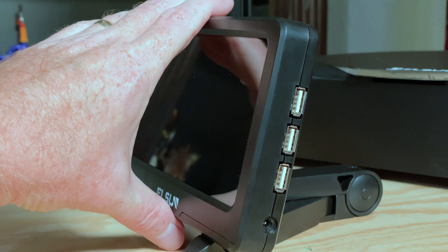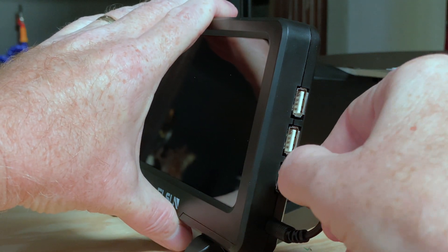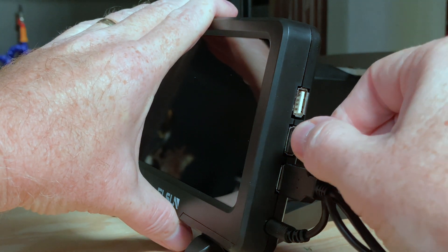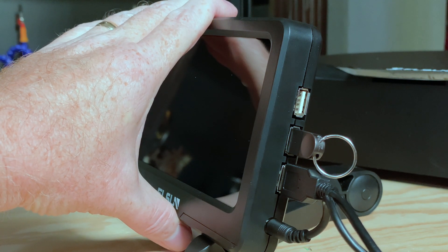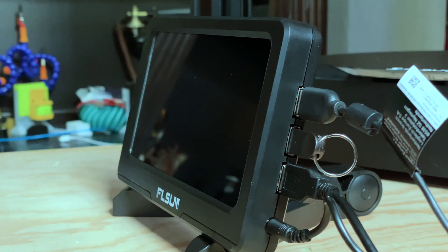The tablet has three USB ports on it. It's connected to the V400 by a power cable and one USB cord. The USB flash drive that comes with the printer occupies a second USB port, and that's used for G-code file storage among other things. And if you want, you can plug a webcam into the third USB port to monitor the printer and make time lapses of prints.